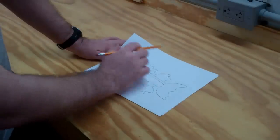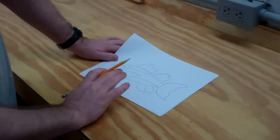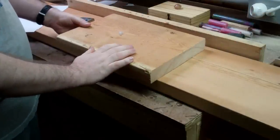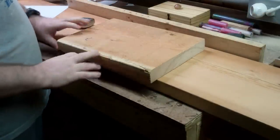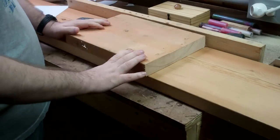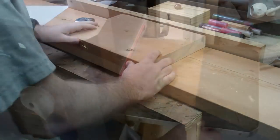What we'll do is we'll cut this off, spray it with some adhesive and put it on that spare 2x. It is pretty rough right now. I'll probably run this through the surface planer to get it a little bit more even. It is pretty rough — this is an inch and a half obviously, but I'll plane it down. The thickness really doesn't matter. You just don't want it too thin. You want this to be a little bit bulkier.